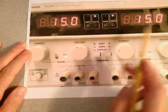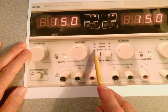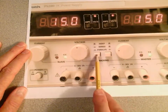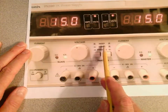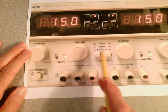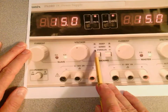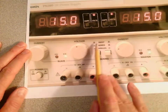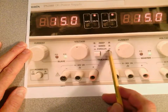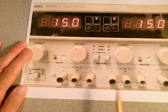You can also put them in parallel — we won't discuss that in detail. To clarify the button modes: both buttons out means independent mode. To put them in series, this button has to be in and this one has to be out. To put them in parallel, both buttons have to be depressed. Make sure you look at the visual here — it will explain it clearly.